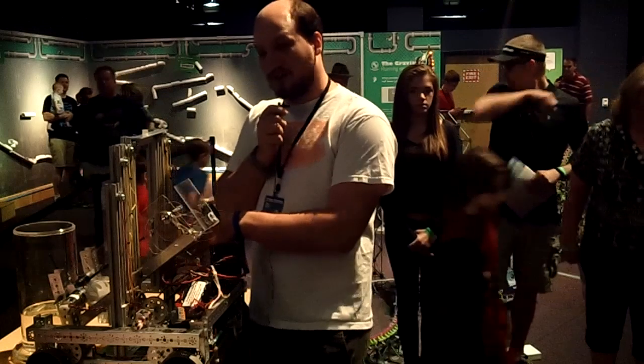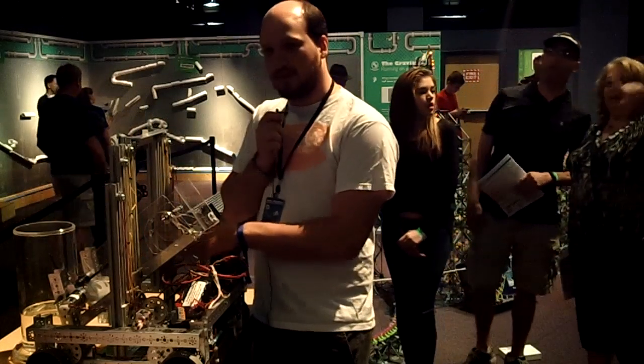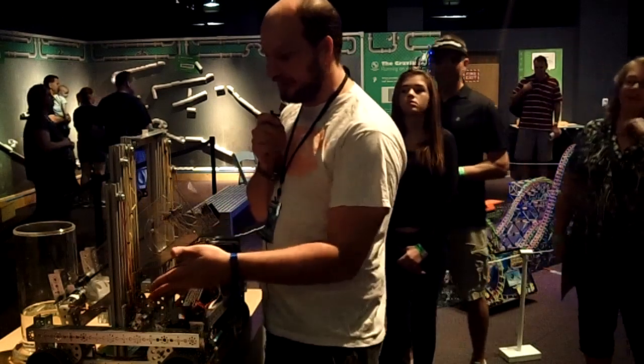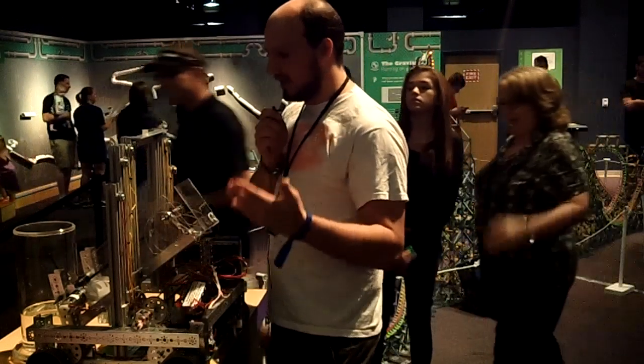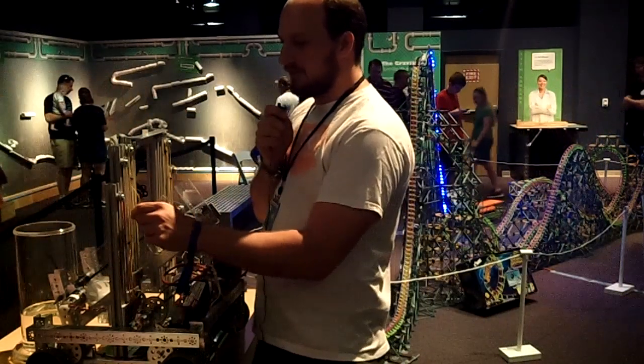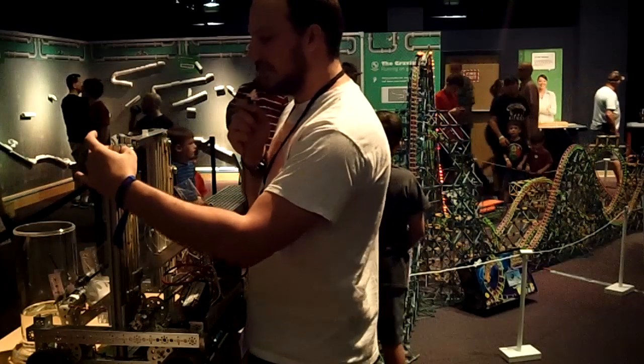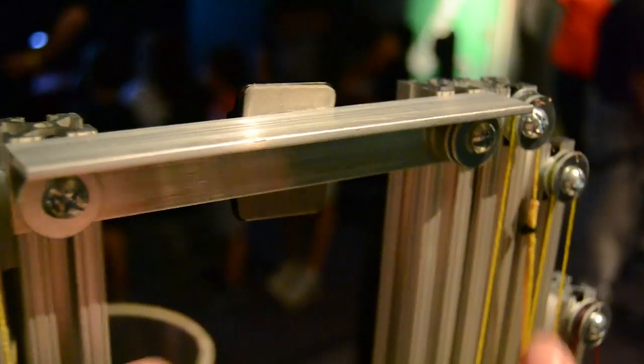Overall, the bearings are relatively tight — not the smoothest bearings. It takes quite a bit of force to lift the whole thing up, which is why we had the shaft bend. With the cascading design, you can see that some of the lines are really loose. You have to tune it so that each cable is the perfect length for all the sections to go up easily. Right now it actually goes up pretty crooked. We also have spacer blocks on the tops — the top bar forces the tops together, squeezing and pushing on the bushings, which makes it relatively rigid.